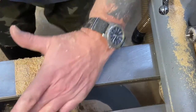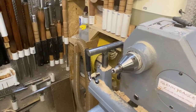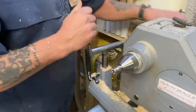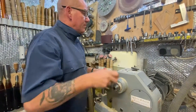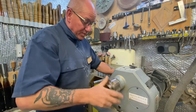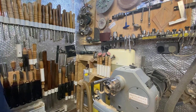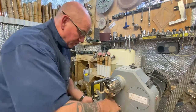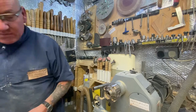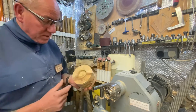Because I know Peter's doing a bowl right now and he's a little worried about it — I think he's overthinking because he doesn't want to mess it up. I haven't really explained the main difference on these cutters, and the big thing is the skip back. A lot of people think you catch the wing of your chisel, and a lot of times that is exactly it — you come off your bevel, your point goes, you get a tiny skip back, and your wing catches. You don't even realise what it is, but if you slow your video right down you can see exactly what caused your catch.